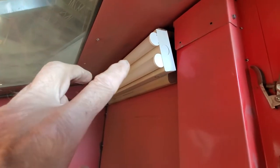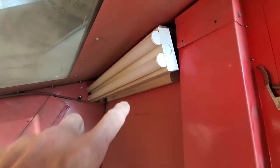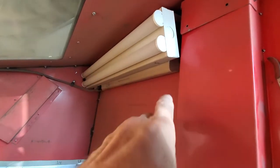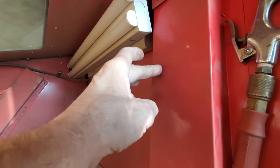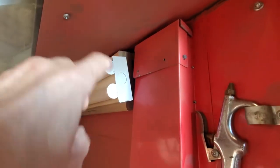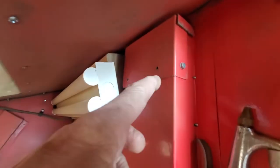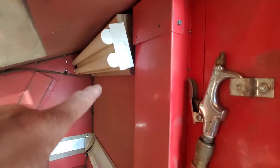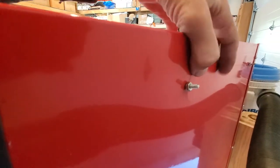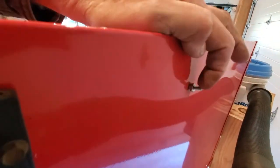You'll see a two-bulb LED fixture from a company called Cooper — the Metalux arm specifically. This is a 2200-lumen LED fixture with covers over the LED lights, so I felt confident about that. I used a 2x6 behind it, between the edge of the factory-installed chute and the wall. I mounted the 2x6 and held it off at the top with a 1x2 on the backside to give it some pitch. What holds it in place are just two three-inch quarter-twenty screws utilizing the pre-existing holes that Harbor Freight had designed for their cheap light.